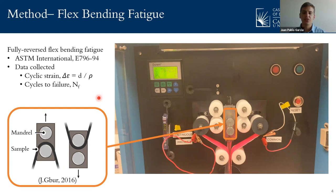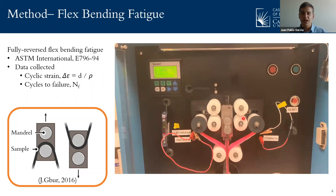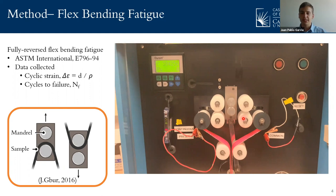Both the 10% and 30% DFT underwent a rotary bending fatigue test, which helps us determine how long the wires can last under a certain amount of cyclic strain. In this video, we can see how the test works. The wire is in between two mandrels that are moving up and down in tension and compression. The important part of this test is that the bigger the mandrel is, the less the wires bend in tension and compression, so the more cycles it can undergo before failure.